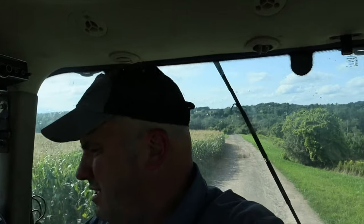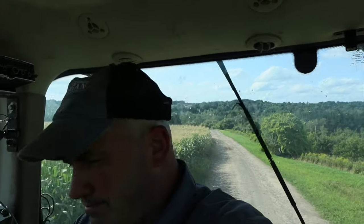Now, we don't really know what happened to this. These brakes were done on this tractor only a couple years ago. This tractor's got 6,904 hours on it, and we shouldn't have to do a set of brakes so close in time here, but we don't know. We might have had a guy operating it, holding his foot on the brake, and what the mechanic said is it could have been a situation where the brakes just got hot and warped the disc. As soon as the disc warps, you're going to have one part of that brake disc coming into contact with the pressure plates or the discs or whatever. So that is what it is, but at least they're done now, and hopefully we don't see any more problems with this tractor.